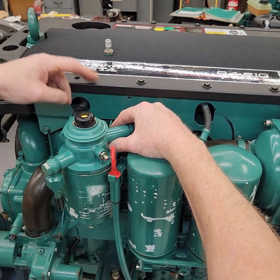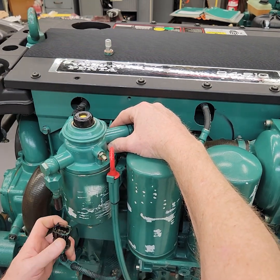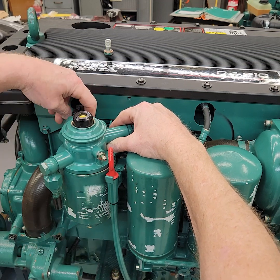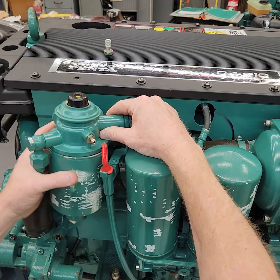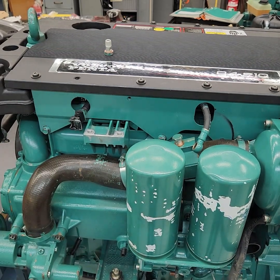I've got the two bolts in the back here. I've got to release the clip on the bottom here to get this connection off for the fuel filter — push it in. Same thing over here. I'm going to push this tab in and then I'm going to take this filter out of the way. So that filter is out of the way.